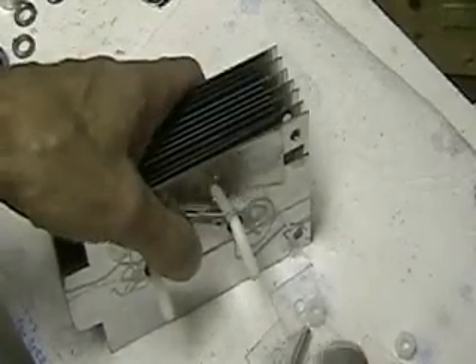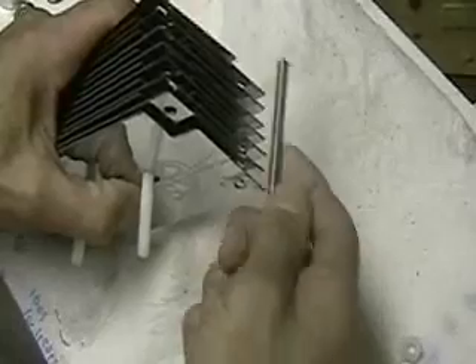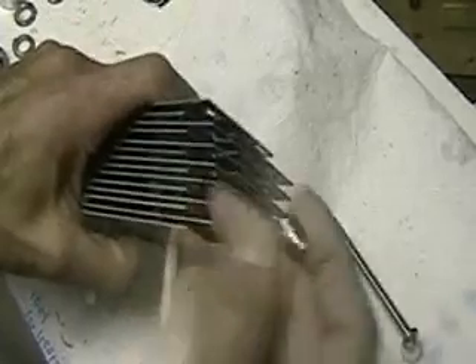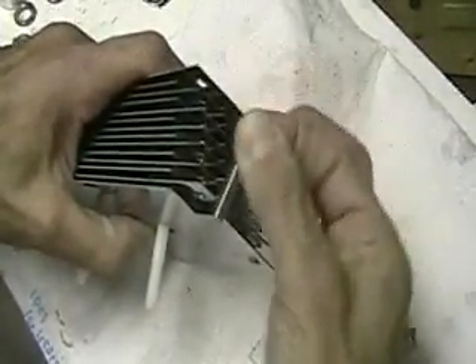The other thing on the Aran cell, which is still standard, is that all the plates are connected through with the electrode on one side and two electrodes on the other side — one going this direction and one coming around this direction. The reason for that is you can turn off one side.